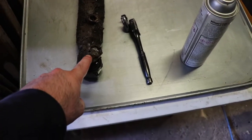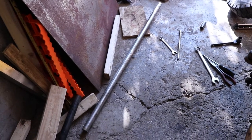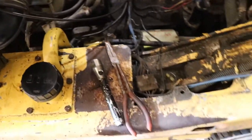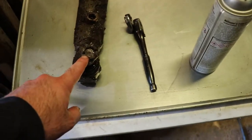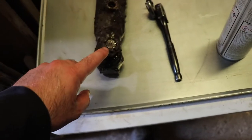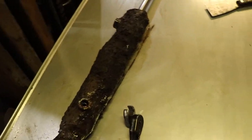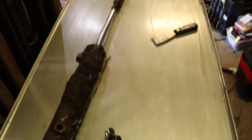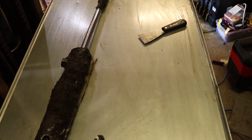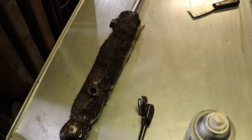I was wrong — this is tapered and was actually quite hard to separate. What I did was use a four-foot solid bar of about inch-and-a-half stainless rod. There's just enough space to drop it up and down in there half a dozen times and eventually you'll pop it off — just get the nut on flush with the top of the stud and pound on it with a solid rod. It was a 17 millimeter crow foot to get the two hydraulic lines off. I should have bought two drip pans. I'll spend a bit of time cleaning this filthy thing off and then start taking it apart.